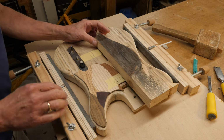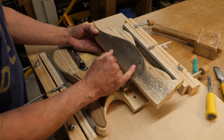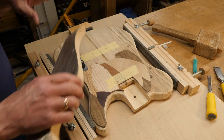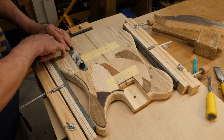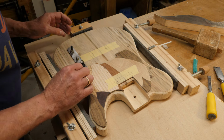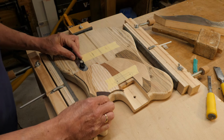and that is to use a dark stain on the wood of the body, something like this. Now this is a mixture of a water-based black with a spirit-based brown. I rather like the effect, especially if it's sanded down a bit. So that's going to mean that this goes darker but still has the grain coming through, which would hide the fact that you can just see a little gap there, which is the hole. And I think, do you know what, that might do the job, because I don't really want a bigger plate here. I think that really looks quite nice. So I'm going to leave it, and let's hope it comes right at the end, eh?